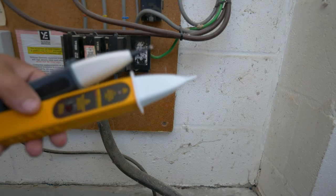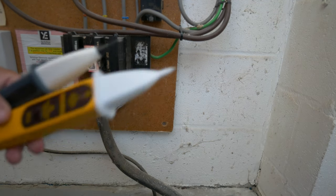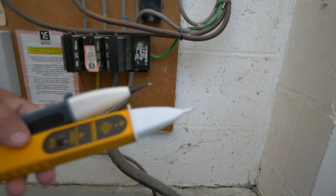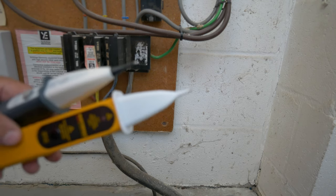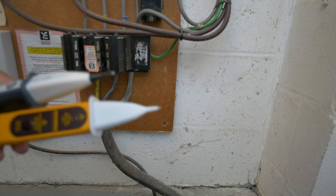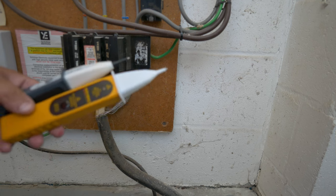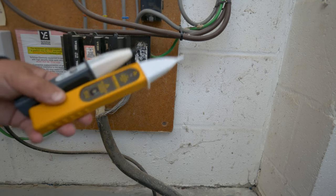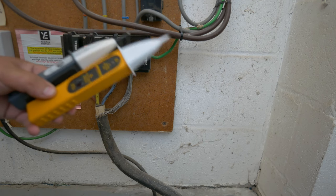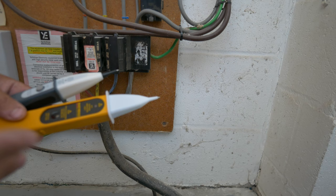There's a video on my main channel Mark the Sparky Allison covering two products: the Q-Tech contact voltage indicator and one from Martindale, and we'll speak about diverted neutral currents in that video as well. These are really useful because you can probe onto your gas pipework, water pipework, any of the bonding connections, distribution equipment, even circuit accessories, and see if there is voltage present within the system before you start to work on it.